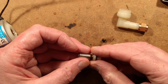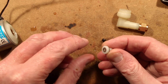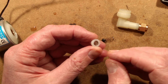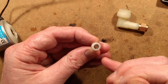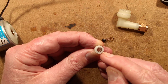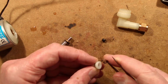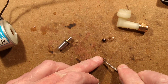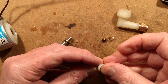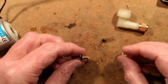If it is gripping too tightly, consider changing that o-ring. As a complete cheapskate attempted fix — as I've done in the past — you can take the o-ring out, use a really sharp Stanley knife to cut a tiny little wedge out of it: put it on a flat surface and cut just the tiniest sliver. Not really recommended, as it won't be up to normal operation, but it can get you out of a hole.